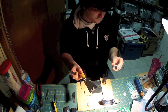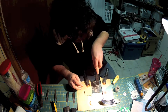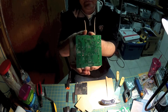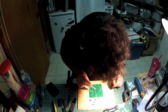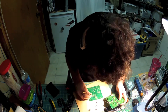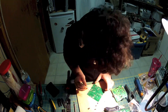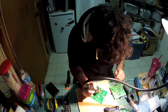It was now time to build my very first button pad board. I first used my solder stencil to evenly distribute the solder paste along the traces on the PCB. Next, I placed each component on the appropriate footprint of the PCB. The first few were tricky, but after a while it became a lot easier. Once all the components were in place, I turned on my hot air rework device. This allowed me to melt all the solder paste and fuse the components to the board.